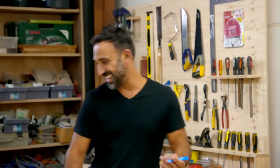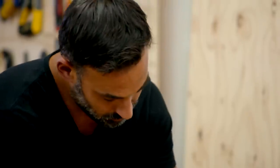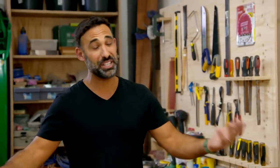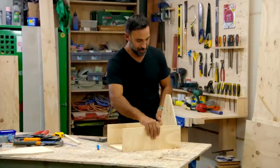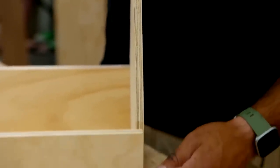For the style, we're going with the old classic toolbox look. I've got all the pieces marked out and I get to try it in my new hand saw. The other good thing about using hand tools is it's actually a workout — look at this bead of sweat coming down my face! We've got our base, our two sides, and then our end. This material is 12mm thick, so I need to mark in 6mm from the ends all the way around so I know where to put my screws.